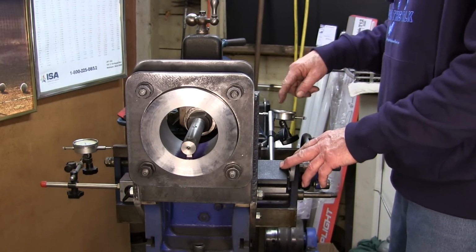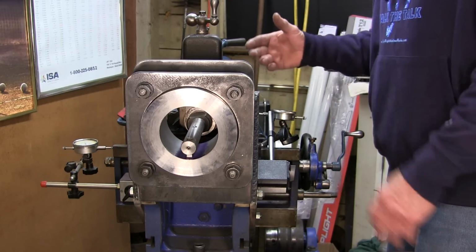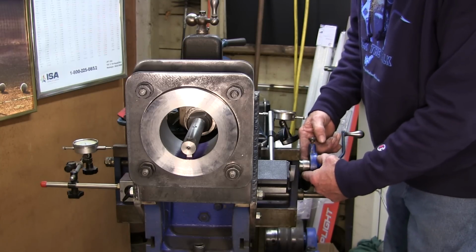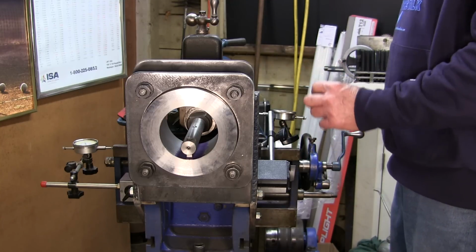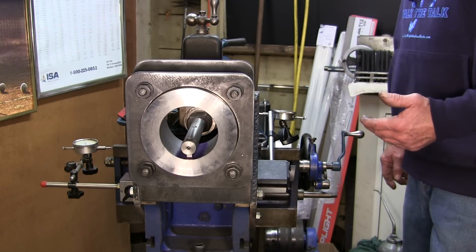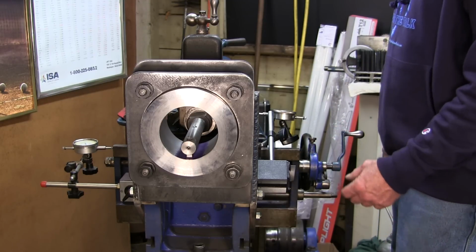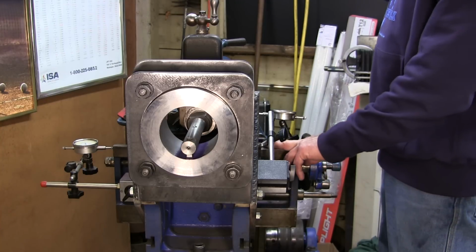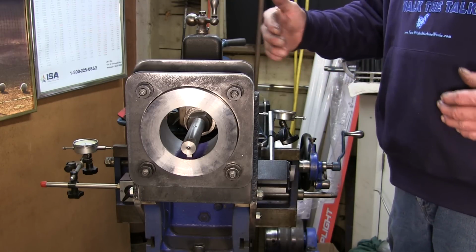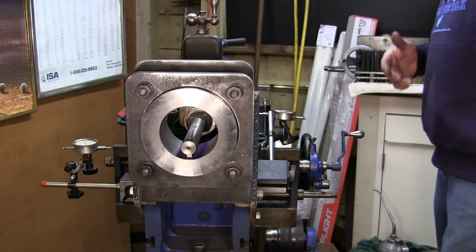We put a dial indicator here and here so that we'll be able to set zero from side to side, so it's a good easy visual. We also moved or loosened our dial so we can go ahead and set it zero, and then we'll probably put a Sharpie dot on that so that we also don't overpass or get outside the dimension we need to go. And we will also go ahead and probably wipe the top of our rail and put one Sharpie line on both sides, meaning the outside travel, so they'll never be underneath. They should always both be visible. Those are just kind of safeties that I'll play in here.